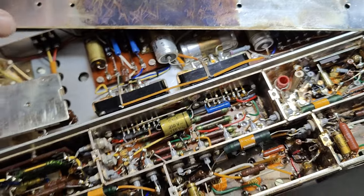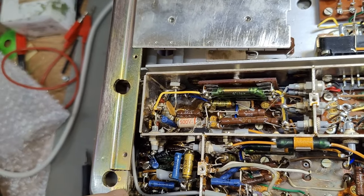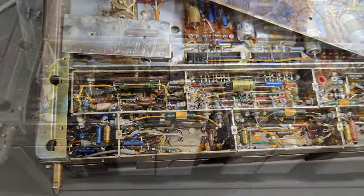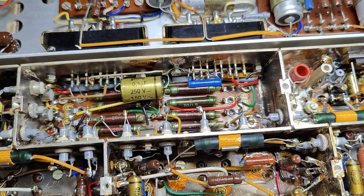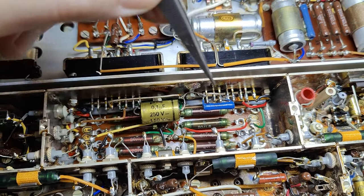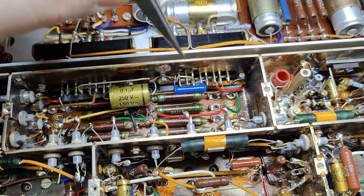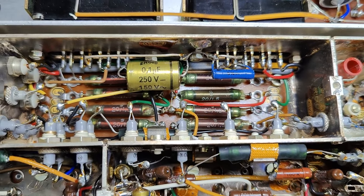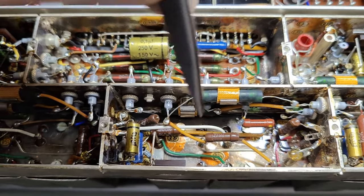I will have to inspect. And by the way, those two screws threw these holes and then they fell down here somewhere, so it's not going to be easy to figure that out again. I am not done having a good time, just enjoying the way that stuff is designed. This is of course power entry and signal entry with the connectors into the entire IF section. And you can see this section here is full of filter inductors and then feed-through capacitors to all the different rooms that are doing different things.